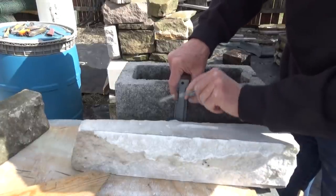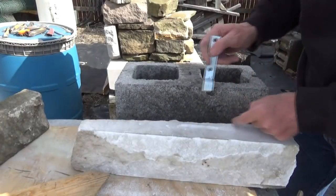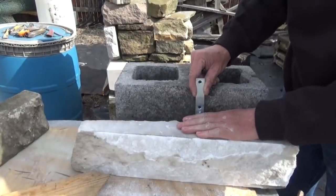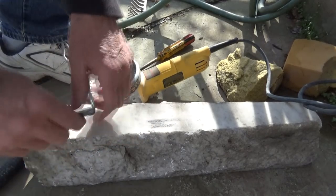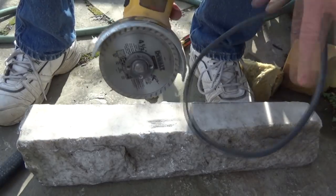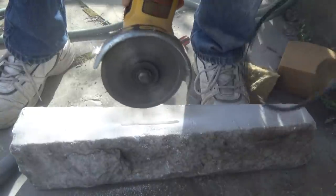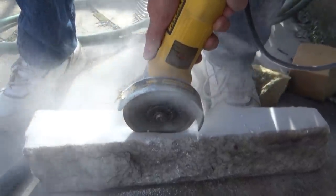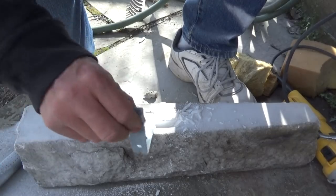Sometimes they have a system where it bolts to the structure — you've seen me do this on brick jobs. We did that on the marble job out in Jersey. The next way they did it is to cut a groove and put the wall tie in there, then either cement or epoxy it to hold it to the building. What we do now is mark here and here, get a little grinder, and cut a hole — then our wall tie goes right in here like this.